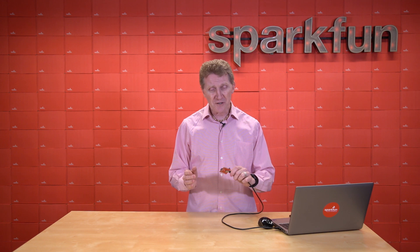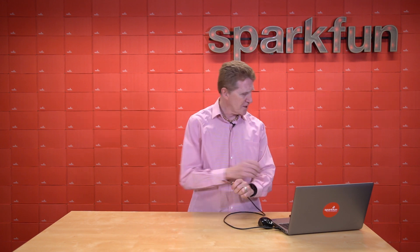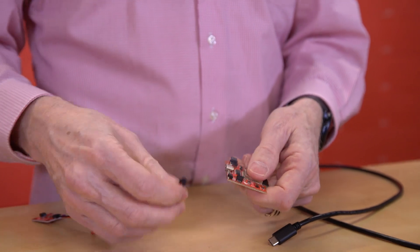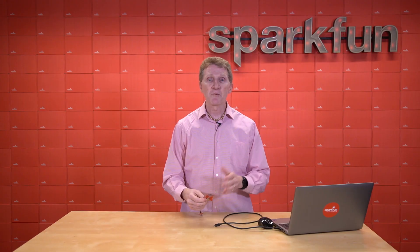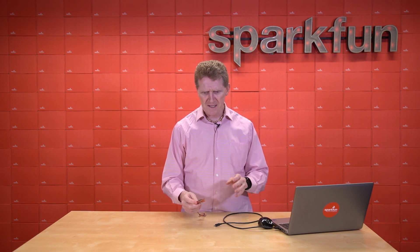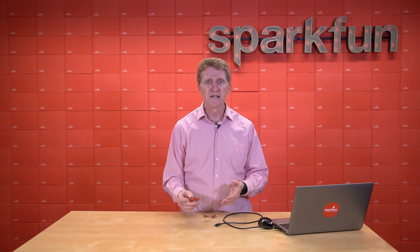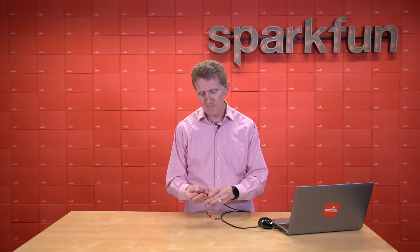Of course, I'm sure you're not going to want to just do this with the board by itself. So let me hook up another couple of sensors to it, and we'll take a look at that settings menu. Now, we all know that Qwiic sensors and I2C sensors are usually hot-swappable. But when you're recording data to a file, that can mess with the file itself — it may lock on all zeros or lock on the last value it had before you connected or disconnected the sensor. So in this case, it's best to just power it down, plug in your extra sensors, and then power back up.